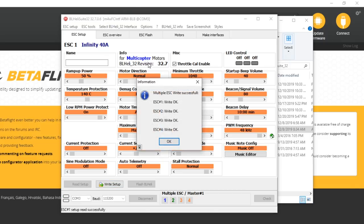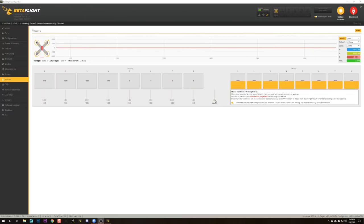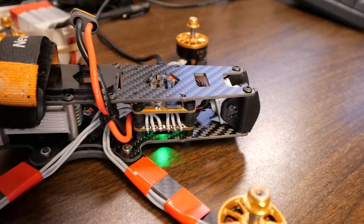Okay, we're good to go. Now, before you run and fly, stay with me. There are a few more things I want to walk you through. First, we got to check and double check that we fixed the motors. I know you think you did, but sometimes you screwed it up. Sometimes I screwed it up. And you know what we'll do? Here's what we'll do. We'll just raise this master slider just a little bit so all four motors begin to spin, and we'll check the direction.